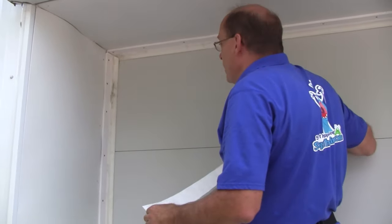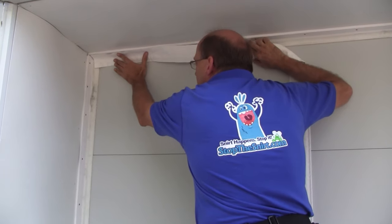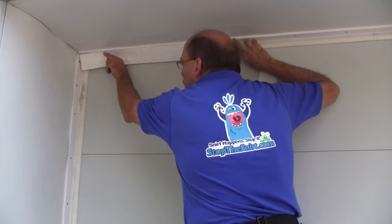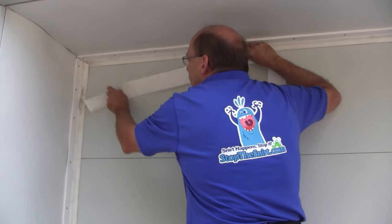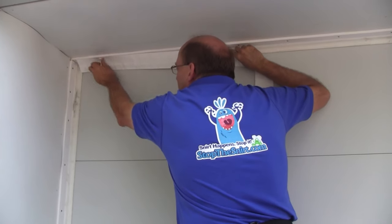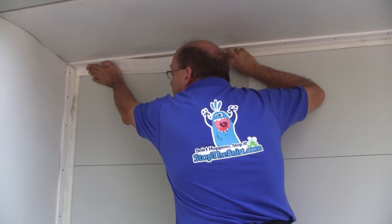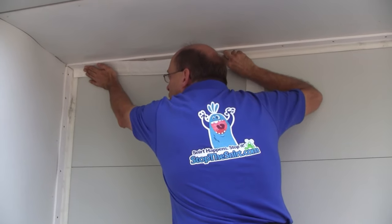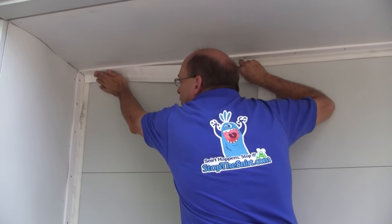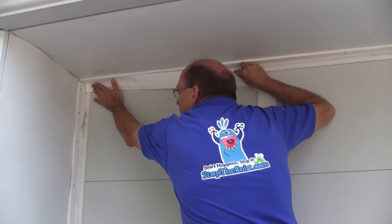When we install this, the insulated loop side goes against the door. We're going to go left to right because I'm right-handed. If you're putting it on existing weather stripping, you're going to line up this edge to be even with it on a residential door. These are a little thicker because it's a commercial door. Generally speaking, you're going to line that up almost close to the edge — anywhere between right on the edge to about an eighth of an inch is good. We don't want to go too far in because when the garage door opens, it'll catch. I'm going to bring it in about an eighth of an inch on this door for a little more sealing.